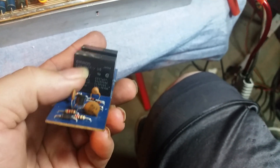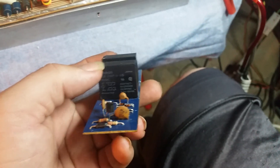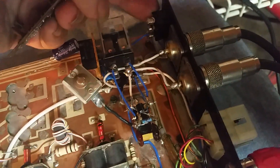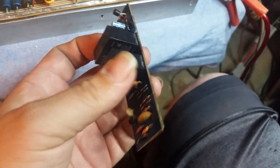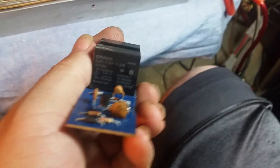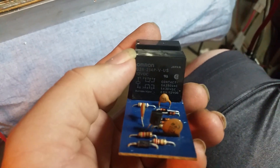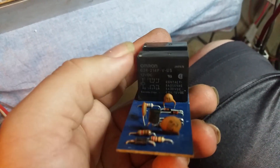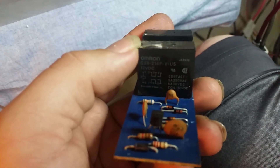But it doesn't even matter — even if it's two drive and eight with all 2879s, he always uses this relay, and I've had problems with these in a few of these amplifiers. I think the reason he stayed with this is just because of the design of the amplifier. This relay can't stand up — it's got to lay down. He would have had to do some major redesigning to fit them on a board like this. I know some people like Dave and others that have used these size relays on five transistor amps that hold up just fine.